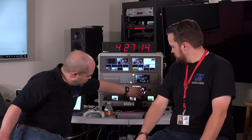Okay, so Larry has one other question here. What size cards are you using on the HyperDecks? I use 128 gigs. It's a Lexar 128 gig, 633 times speed, and I put two in each unit, so when one fills up, it spills over onto the second one. It's the best bang for the buck right now. 256s, you pay a premium. And it's big enough that I can record video for over an hour before it spills over from one to the other.